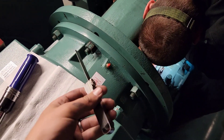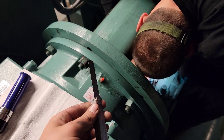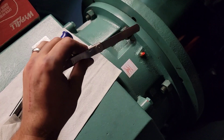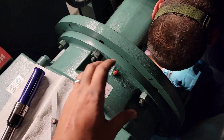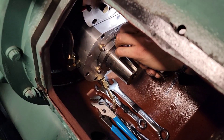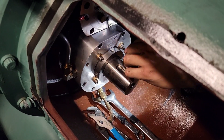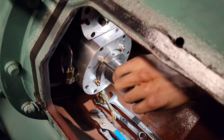The critical key to making this successful and easy is to just take your time and go slow. He's doing the final tension now and we were able to get all this within eight to nine thousandths of an inch all the way around — excellent job. Make very equal, even movements all the way around and it will pay off. We've got all lines reconnected, everything tightened down. Now we're turning those little keeper pins out of the way so the shaft can spin freely — this piece of it is done.